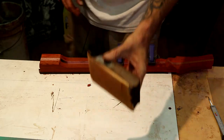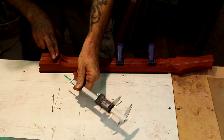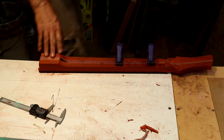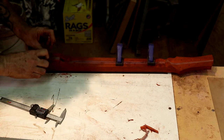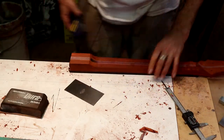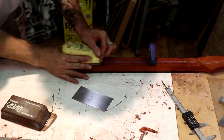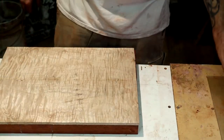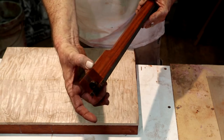I'm a little higher on this side — it's very little. I'll take this sanding block with 80 grit on it. We're a little higher on the back. Now I'm going to take my scraper and clean this up. We're in good shape — a little sanding and we're going to be all right. We'll switch over to 180. We're flat — within 0.03 millimeters on all four corners of this neck heel. Really close.